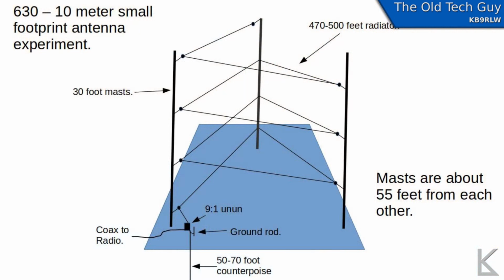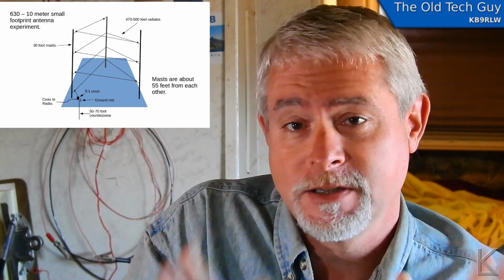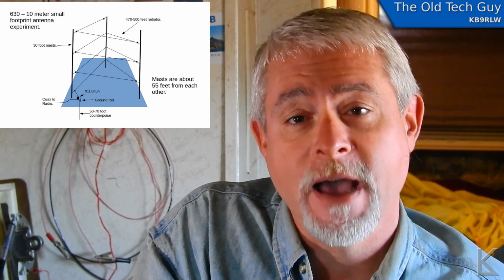And then we can get to testing my original idea for getting a long antenna into a small space. You ready for this? It's kind of a crazy idea. I have no idea how it's going to behave. Here's a picture of what I'm thinking about. I don't know what I'd call it. Maybe the delta spiral, because it's in a delta shape and spirals up. But the idea is that in a relatively small space, you can extend that wire, spiraling it upwards with a fairly large gap between each turn, so that will reduce the inductive properties of that geometry, perhaps. It's just a theory, okay? It's just an idea, and I want to build it and see how it behaves.